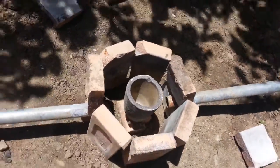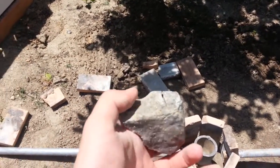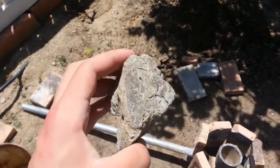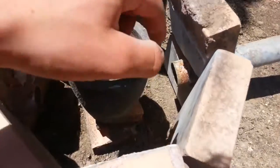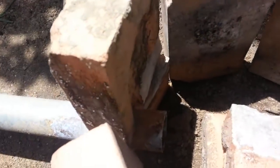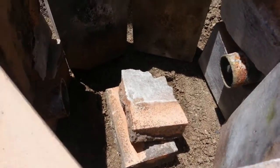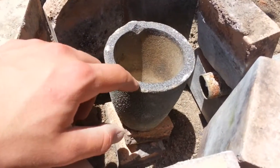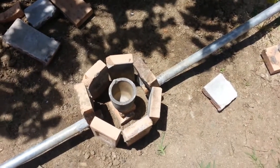If I show you this brick here — the one that was right in front of the tubes — it's been destroyed pretty considerably. Seeing that, I've decided I'm gonna have the two tubes running right into the crucible, so the crucible is gonna sit right into these two tubes, and hopefully that will get the most heat. Also, it's gonna be placed on a platform, which is the difference with the previous one which had two bricks holding it — those were kind of unstable.